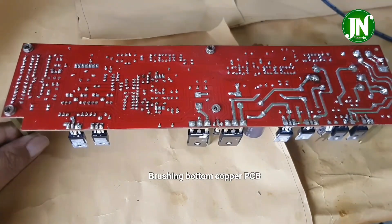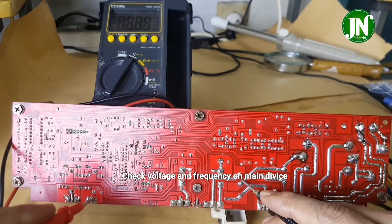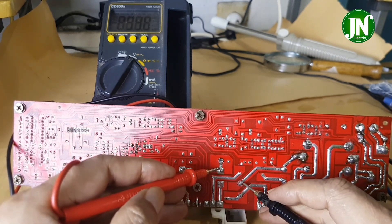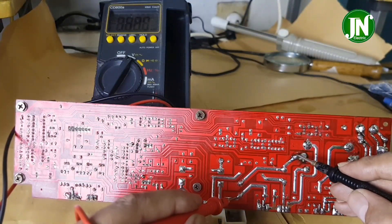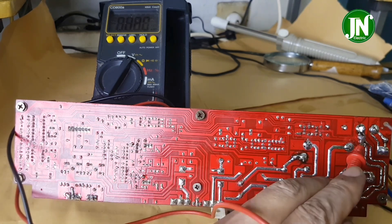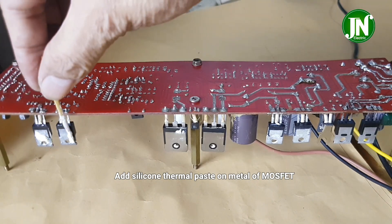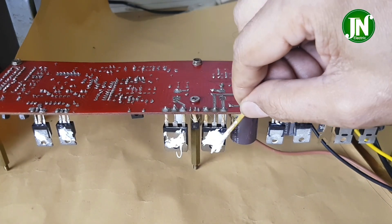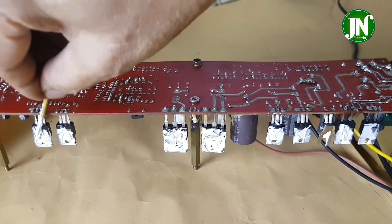Using a large brush is also helpful to clean residual component debris from under the PCB. After power is applied to the active speaker unit, I have to check important parameters — namely whether there is a voltage reading on the regulator. I should show important data from the voltage and frequency. Applying a small amount of silicon paste to the metal surface of the semiconductor is essential to facilitate heat absorption of this transistor.